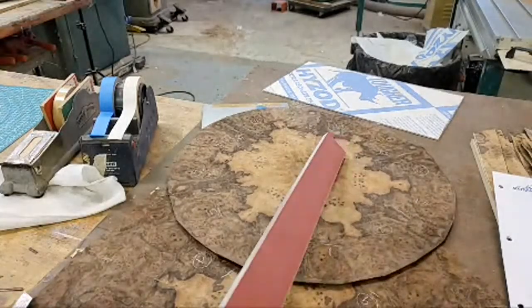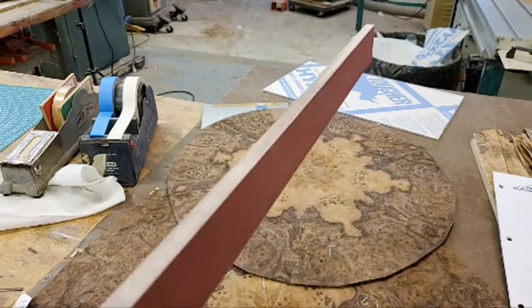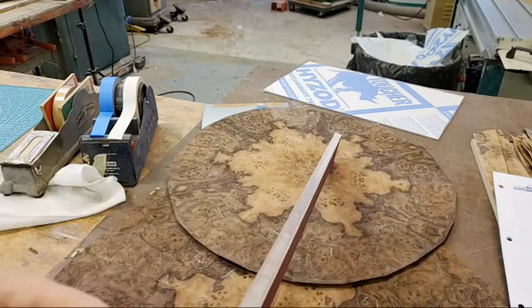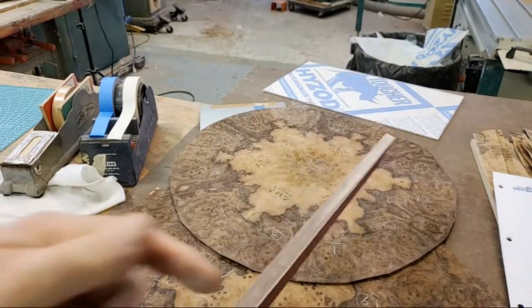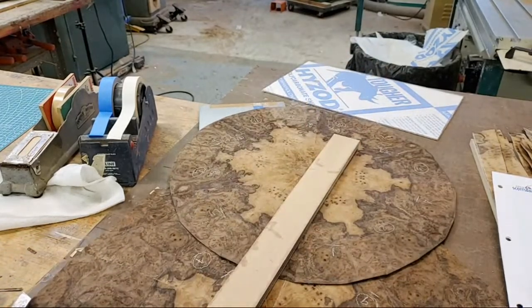Back to tips and tricks: if you're looking for a straight edge, this works really great for large, long runs. If you don't have a large aluminum bar, just make these straight edges and seal it with some CA glue. I use this method for template guides also for routing, so the bearing runs on a slightly harder surface.